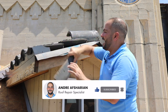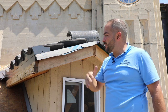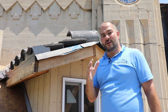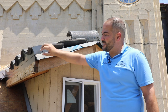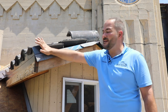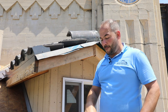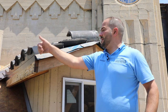Number one is how the tile finishes off. One thing you want to be sure of whenever possible: have both sides of the rake be symmetric so they end at the same location. The other thing you want to make sure you do is curve and bend your birdstop up. You can see this is our metal birdstop, our eave riser that we've cut and bent. This is going to prevent birds from getting in here, because we're going to have a little gap that birds can nest in. So if you want to prevent that, go ahead and bend your eave risers in.